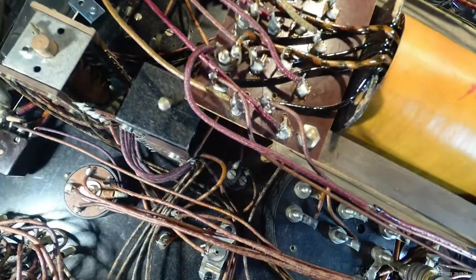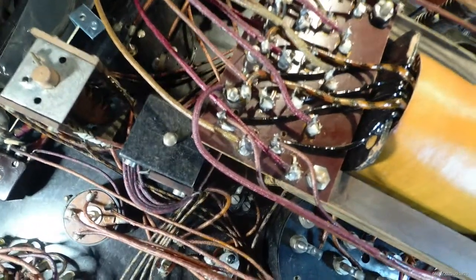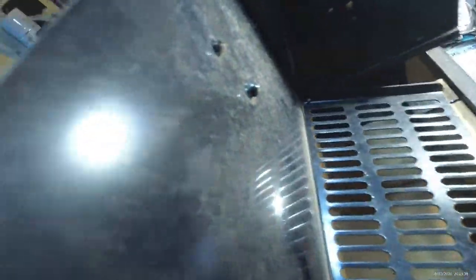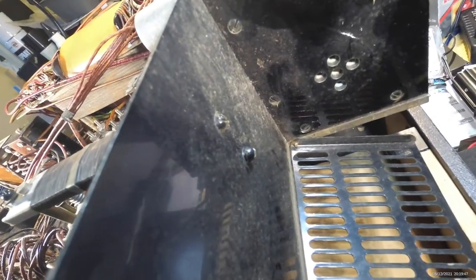On the other side, the heating voltages — you can change something there with the switch position or potentiometer adjustment; I'll show that again. And what I forgot from the top: behind this flap there is normally a rectifier tube — which is unfortunately completely missing.